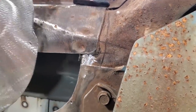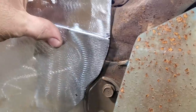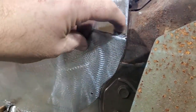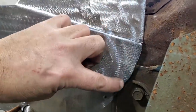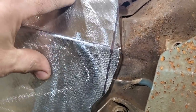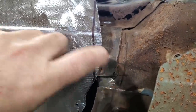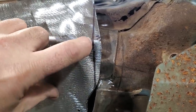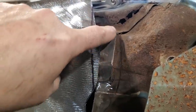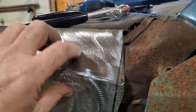now I can see roughly the angle that's coming down through here. You can see the angle that I got to cut that on through there. And now from there, I'll mark back to here and just cut it on a straight angle up here. And I'll come down this way on an angle to meet down here somewhere so I can trim that up nice. So you can see I got a mark on this, and if you look at it, you see I transferred this shape here, this line here, from this here over onto this here. The distance from here to the line that I drew, I measured back to here and marked it, and I just drew a little parallel line to come down, and you can see this comes straight down through here and just continues on straight. So I'm just going to take this now and trim that off.